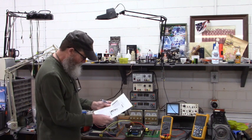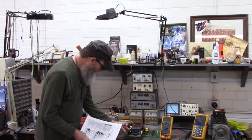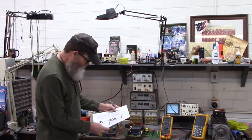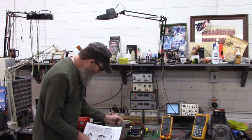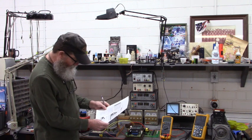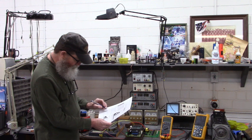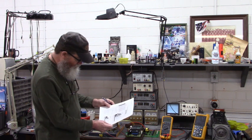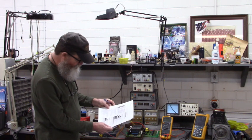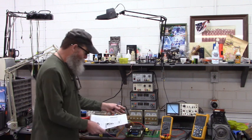There's another way to perform that lockout function. You have these switch inputs — X1, X2, X3, X4, X5, X6, X7, X8, X9 — on this terminal board on the CPU board. These inputs are programmable, and one of the programming functions is a value of 19: write enable for keypad data change permission (WE-KP). So if I were to set any of these parameters E01 through E09 to the value of 19, we would have to use a switch input to unlock that keypad. We're going to perform all these experiments after we get this drive powered up.